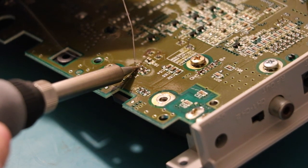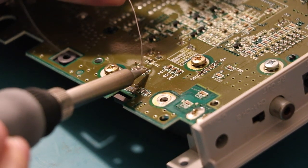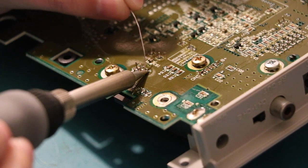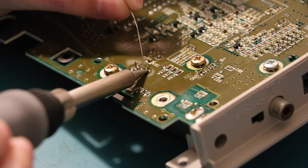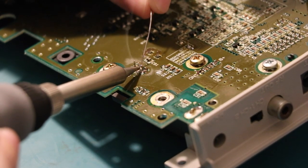Ah, yes, the sweet smell of solder going directly into my eyes. Don't know why my eyes can smell it, but... Oh wait, my nose. That would probably have something to do with it.